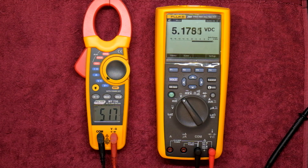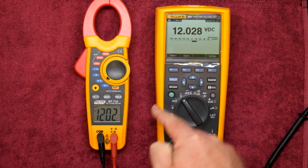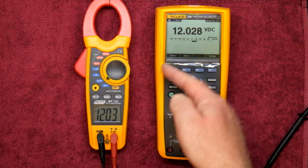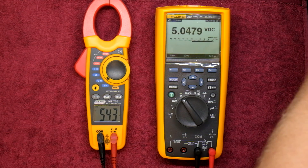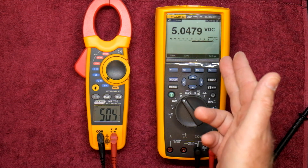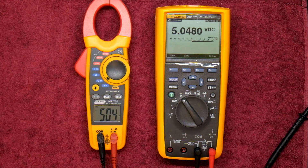Let's go to a more reference voltage source. We've got 12.028 volts on the Fluke and 12.03 on the MajorTech — so it's rounding off correctly. When it drops to 12.02, you can see it's borderline but still well within spec. At 5 volts, the MajorTech shows 5.04, and the Fluke shows 5.04 to 5.05 hopping. I'd say it's still damn accurate for a clamp meter.